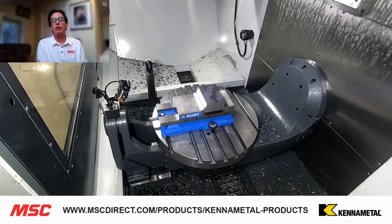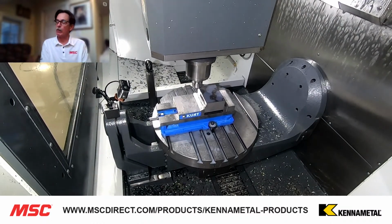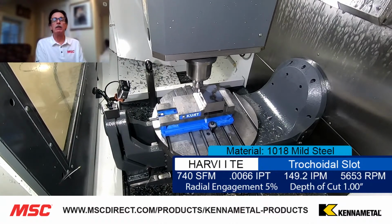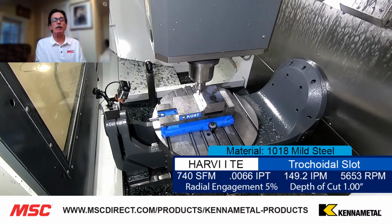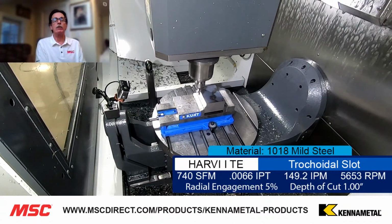So now we did a little more aggressive cut here at a 60% step over at 600 surface footage, 2.5 per tooth. It just buzzes along. Here is a trochoidal arc. That's a very popular approach today, and that is one way to utilize that equipment you have. That's also a tool life stretcher there.